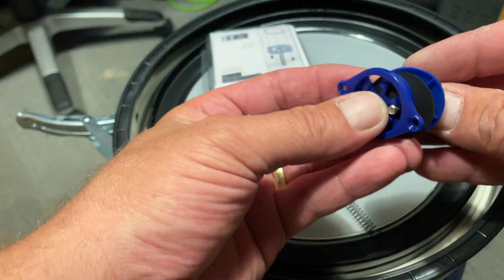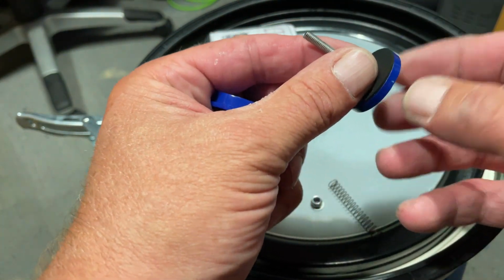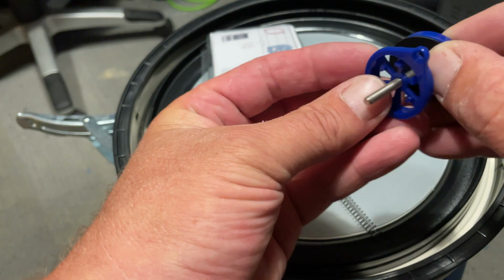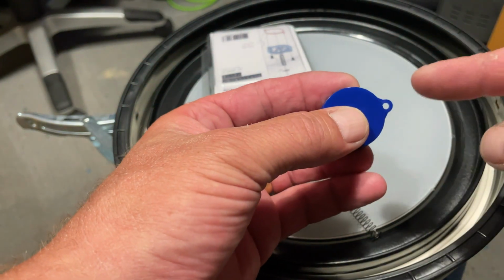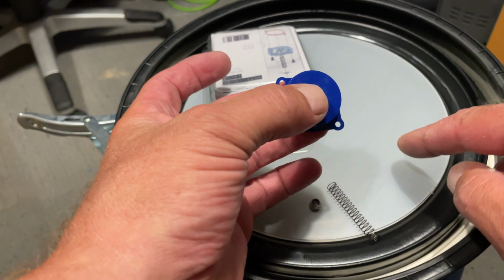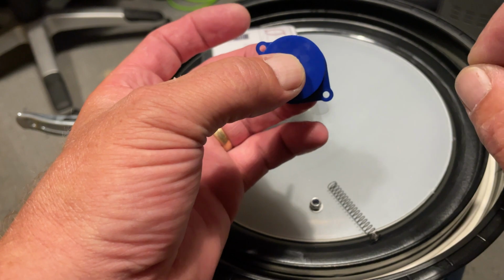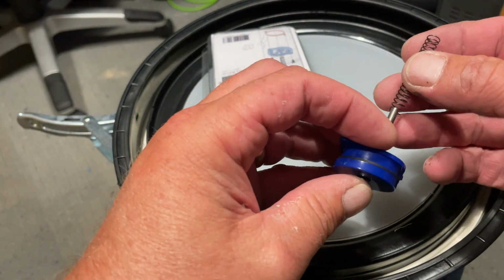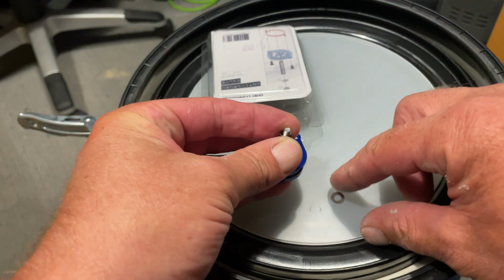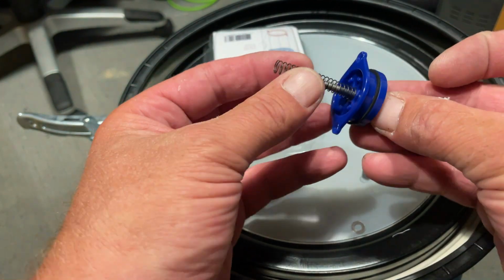Here's how it's assembled. You have the top, the rubber bush, which gives you a level of air tightness, and then the body of the unit, which also has 2 fixing holes. I do recommend on Perspex you don't put the screws straight into it; always pilot drill it first. Perspex, as we all know, is a bugger to work with. It's very brittle and takes very little for it to go. Then there's a spring which fits onto that fixing.